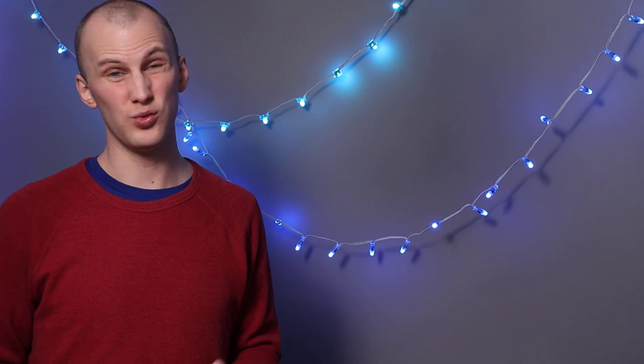And then last, how are you looking to run things? If it's simple enough for you to run things wired, run a wired network connection to each box, get it done, easy. But a lot of times, especially like maybe you are running something on the other side of your driveway or something like that, it may make more sense to run wirelessly. And when that's the case, when it makes more sense to run wirelessly and maybe use multiple FPP devices together in order to run that show completely wirelessly, that's the moment when you go, okay, I want to use a controller that has an FPP device built in, or put an FPP device, a Raspberry Pi or a BeagleBone, in the box with my controller, and then use the master remote functionality to be able to run your show that way.